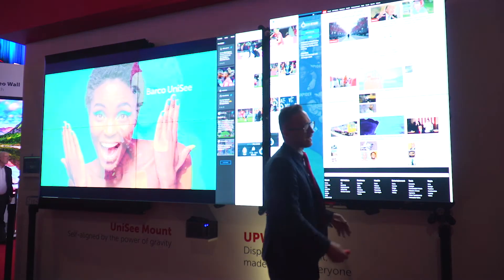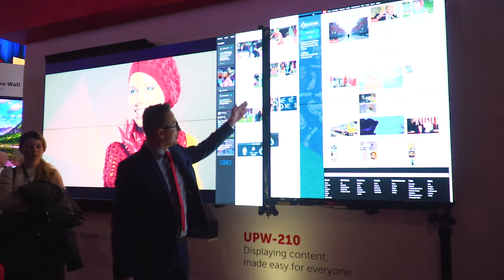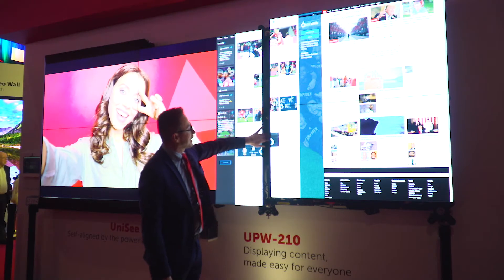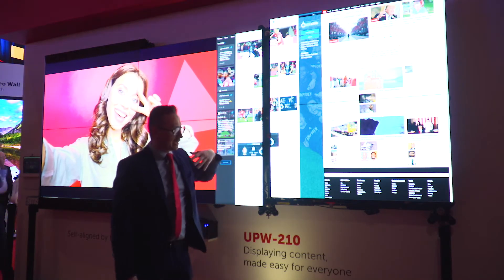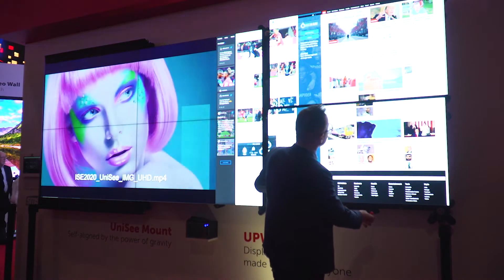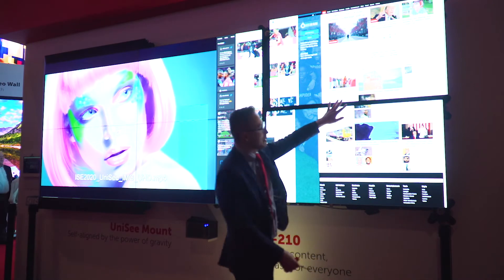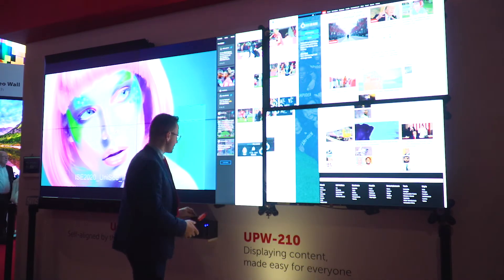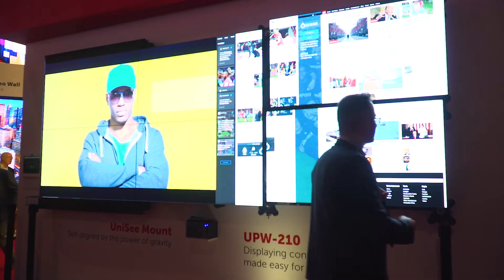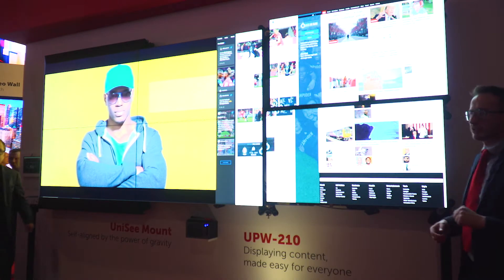When the column is slid out, we can get access to a red point that tells us which screen we want to put in service mode. We select this screen, there is a click, and then we put the screen in service mode — we push a button and we create a 3cm gap around the screen. This 3cm gap allows us to remove the screen easily without damaging the border.